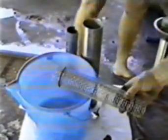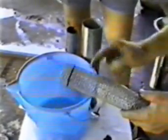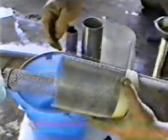Square meshing. He said he was hoping this would work. This does not work nowhere near as well because the wires are sealed wire, and they're just interlocked. Now the current seems to be able to go through and past. Where, if you have welded mesh, solid welded mesh, the current can't circulate and go past. You'll come down to the square and break out in the four ways and put your gas out.